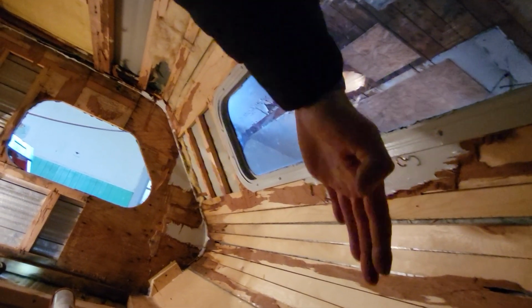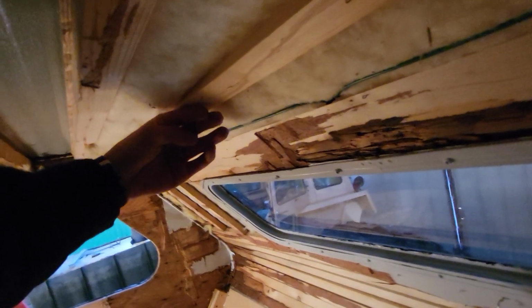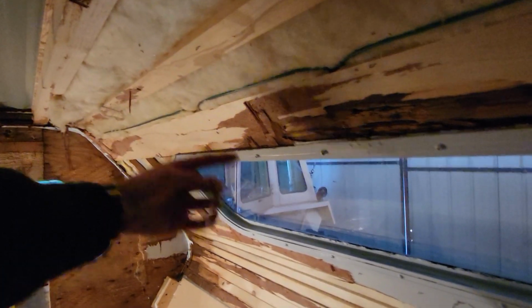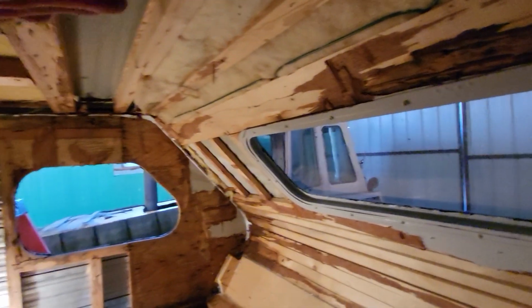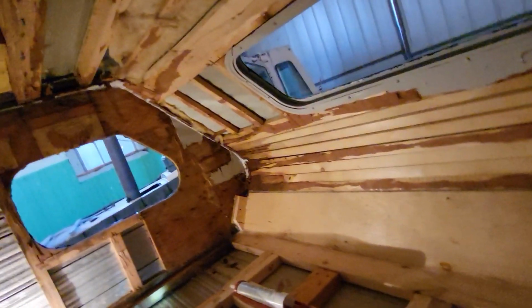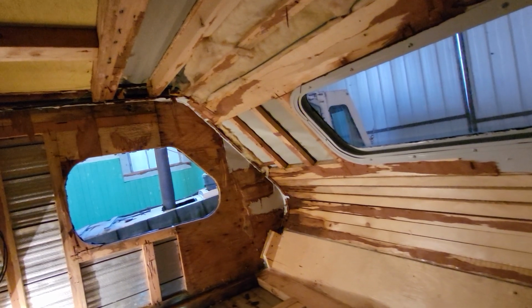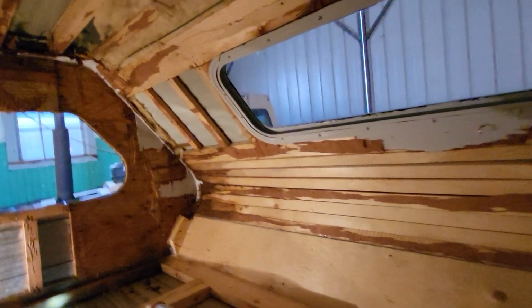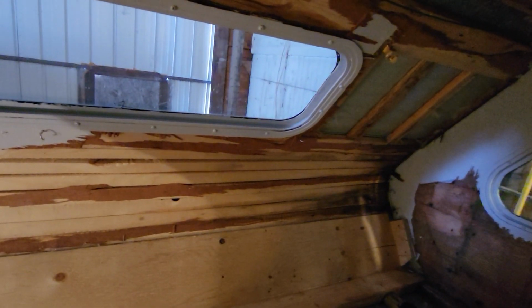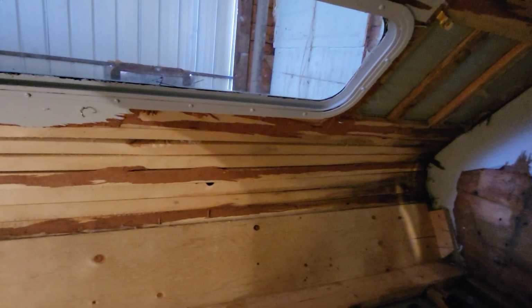This is awkward. And then I could follow that up to the ceiling, and I would come to right about there, down, and then I could just frame the 2 inches down to come into that. That would take a lot of contouring and a lot of spray foam in the front, but I think it would also guarantee that this upstairs part would be a little warmer as well.